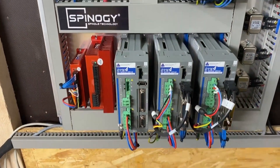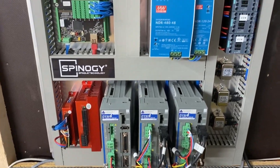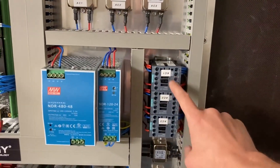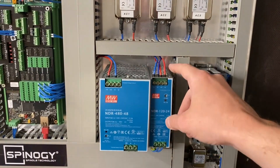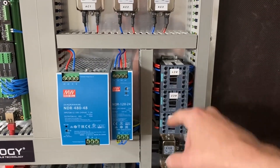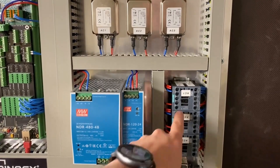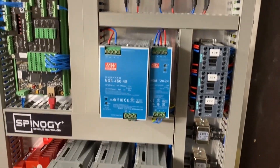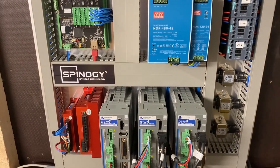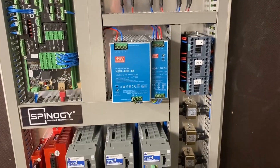The second wire goes on to the small EMI filters and from there they go off to the logic power — also 230 volts AC. Those contactors are powered by 24 volts and wired to the e-stop, so if I push the e-stop those contactors will release and the servo drives all shut off at the same time. That's pretty much it for the servo power side.